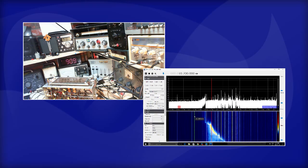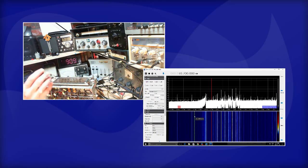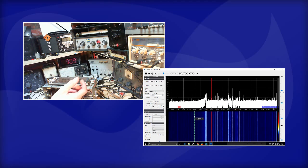So now what's going on here is 100 megahertz is being deviated, if I can use that word. It's moving back and forth above and below 100 megahertz, and that's causing a similar signal in the IF, moving back and forth around 10.7. Something like that. So I think what we're seeing on the SDR right now is one edge of this travel, if you like. And since it's outside of the 10.7 IF range, we can't really hear it on either radio.